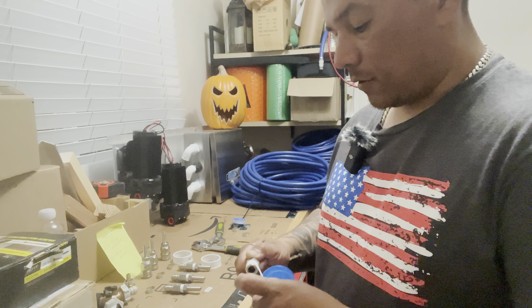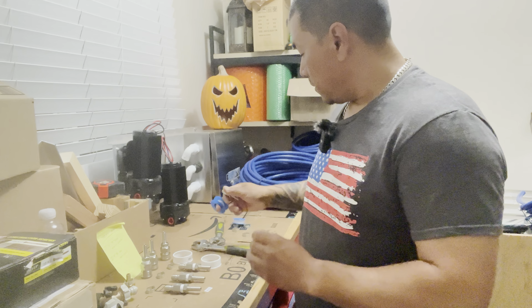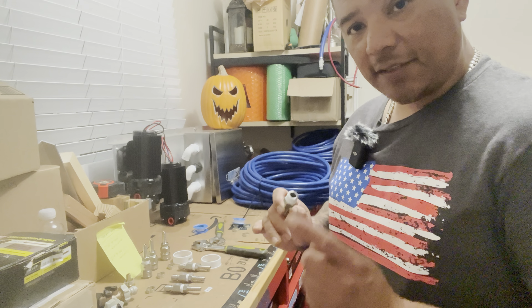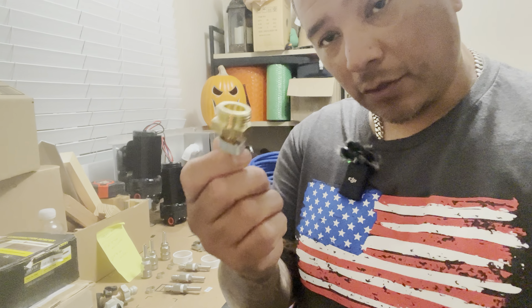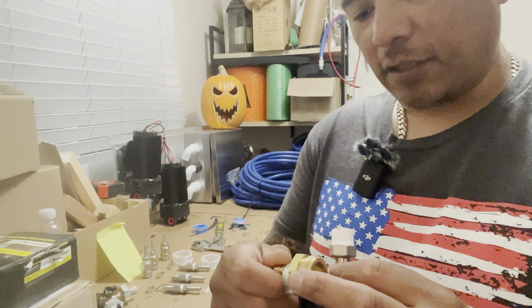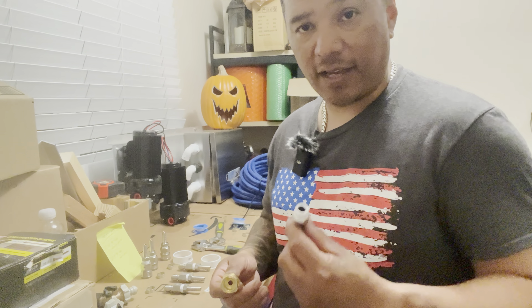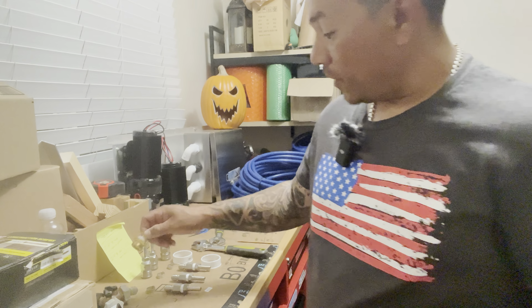The convenience of this is that you do not have to purchase extra tools to crimp everything down or go online shopping trying to find your fittings. I'm using stainless steel hardware. The only piece that does not come in stainless steel is the male garden hose fitting — because most of the time these will wear out if you're dragging it across the lawn or concrete. It can be replaced easily. Everything else, including your quick connects, will get replaced every so often. On my system, my quick connects have been on my vehicle for over three years because they're not under high pressure.